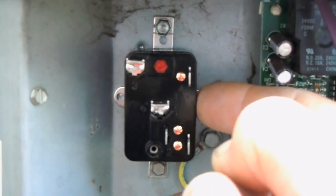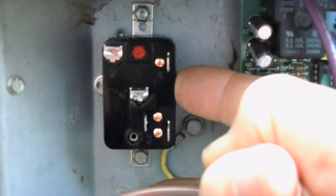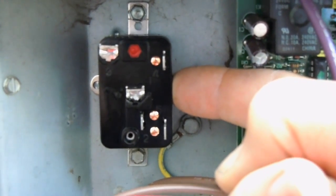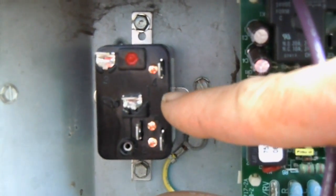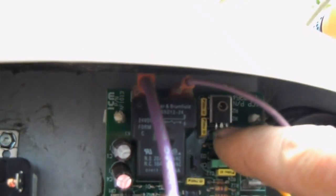So that's why I decided to just use this relay to energize and de-energize the crankcase heater. The other good thing about this is the relay has a coil at 208 volts, so it'll operate on line voltage, and there will be no extra load on the triac on the board.